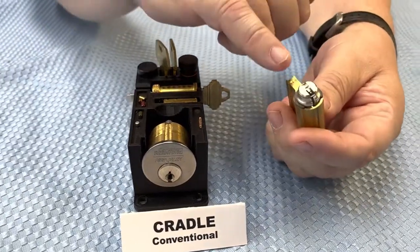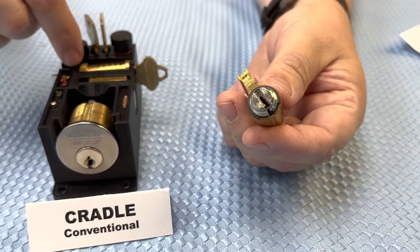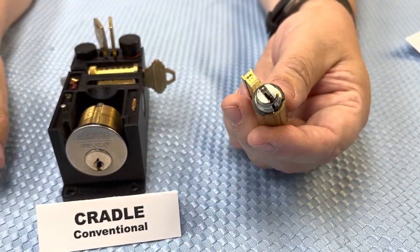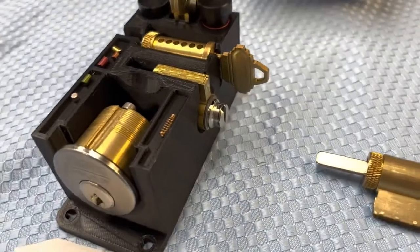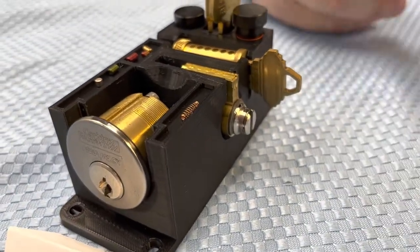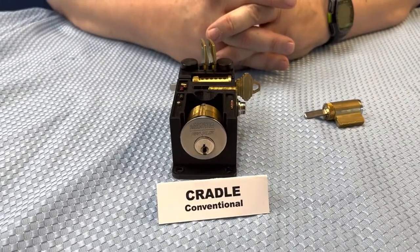Many times this ring on the back side — for manufacturers that don't have a cap and spring but have that true arc ring on the back side — you can put this in like so, and now you've got a secure way of getting that e-ring off. So again, this is the LockCaddy Cradle Conventional tool. You can buy it from any of the locksmith wholesale distributors in your area, or you can go to www.lockcaddy.com. Thanks for watching.